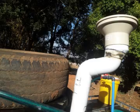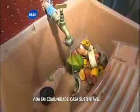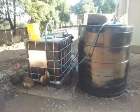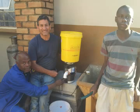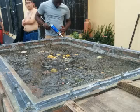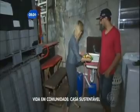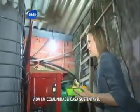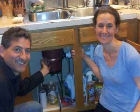Finally, put a funnel onto the feeding pipe where ground-up kitchen scraps — old banana peels, plate scrapings, and so on — are poured. Unlike most compost piles, there is no food waste you can't put in: fruit and vegetable rinds, cooked food, meat and grease — you name it. You just have to grind or mash it up and mix with water; dirty or soapy water is fine, so it fits down the pipe without clogging. In the Dominican Republic, we used 5-gallon water jugs cut in half as funnels. If you build your digester lower than your sink and install a food grinder, hook up the outlet of the grinder directly to the feeding pipe — just don't forget to have a pipe or hose attached to a T to prevent a vacuum lock.